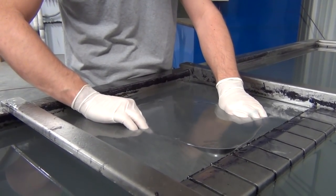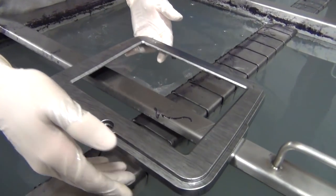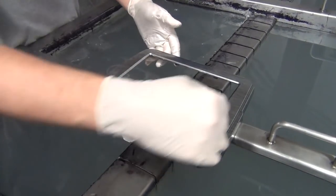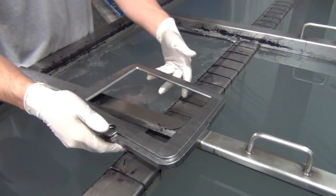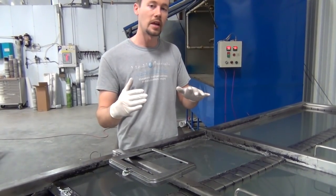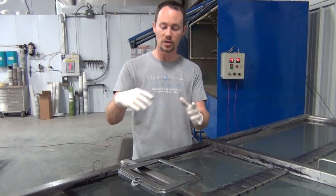You can see how that very edge is the last part that goes down into the water. We have one little spot that will pretty much go away, but we have all of our lines going this way and that film was wrapping around all the way around these areas and then all the way around in here. That's something to definitely keep in mind: whenever you have a part with really sharp edges, make sure you go into the water at different angles so you don't get big spots that void out, and the film has plenty of room to wrap all the way around inside that hard edge.